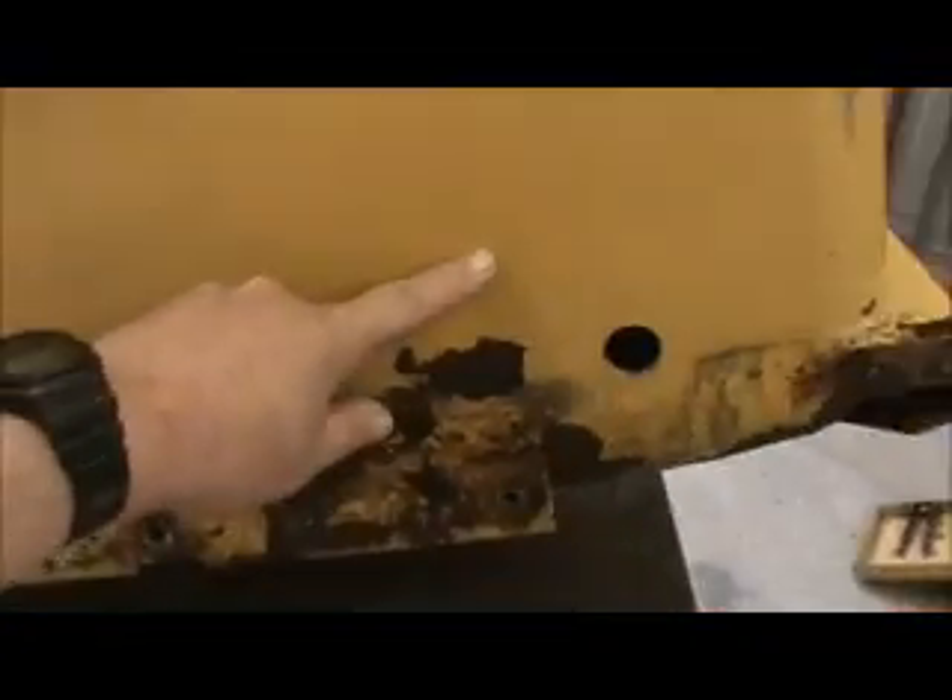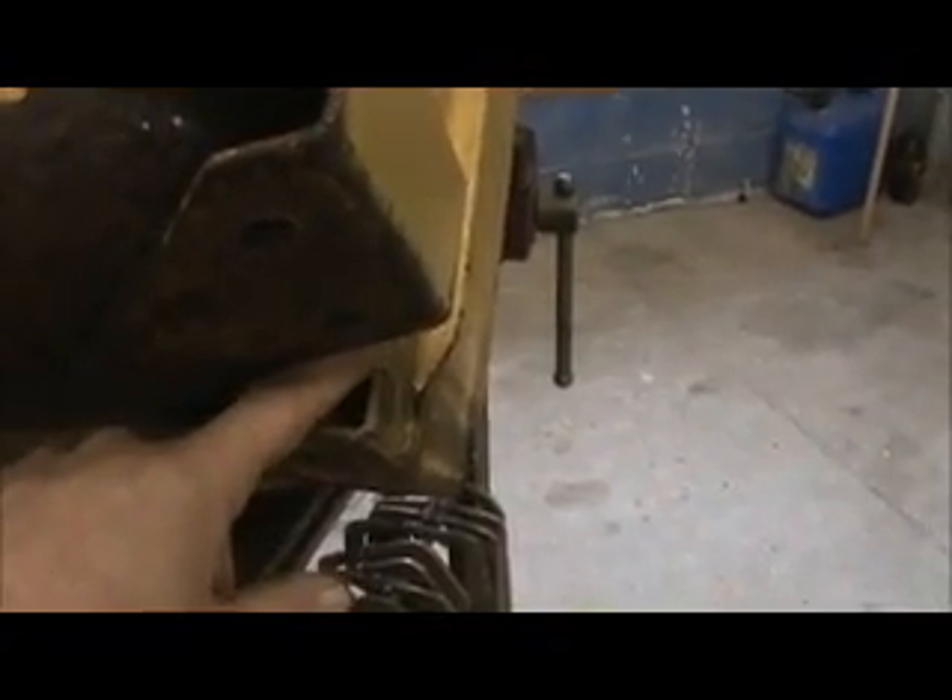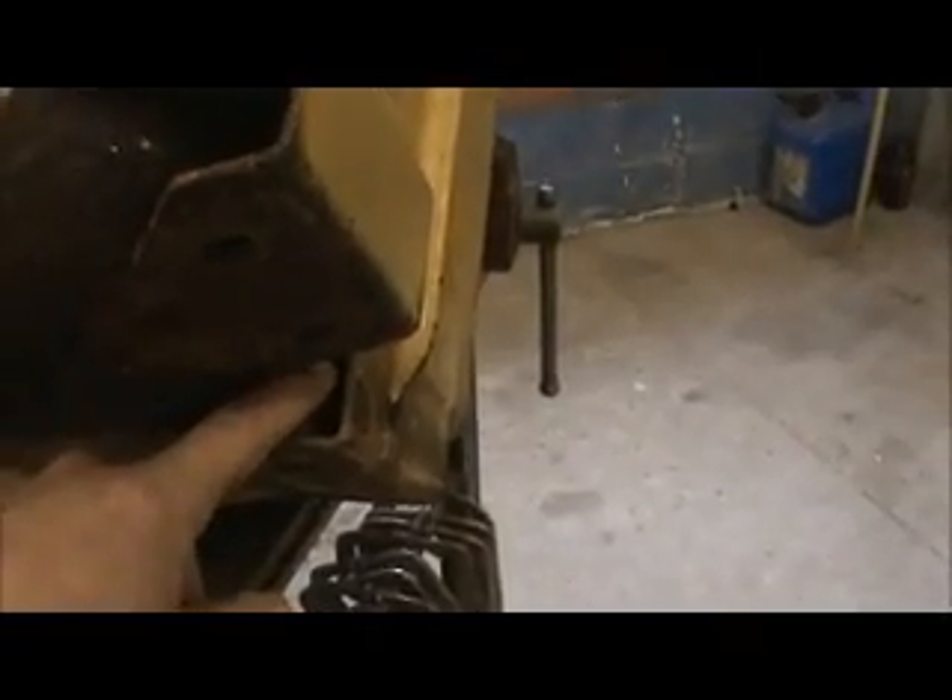We're going to cut the bottom of this tank out, probably right up around here. It's going to be a little complicated — there's a lot of angles to build. It doesn't necessarily have to be rebuilt exactly like this. In order to get the tank out you actually have to lift the cab off, which they didn't want to do — they were able to manhandle it out. So what we're going to do is make the tank itself one inch shorter in height, so it'll just slide back in.